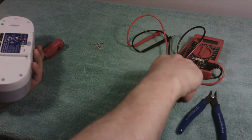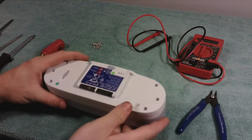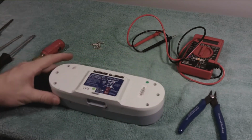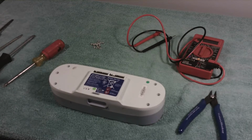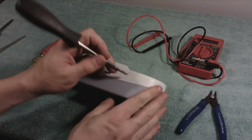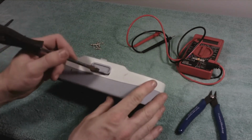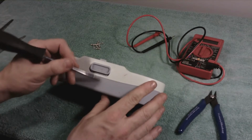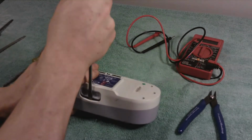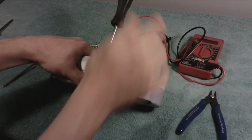I need to install not only enough solar to power the mining rig, but enough solar to power the mining rig for 24 hours. To make this really simple, let's say my mining rig pulls 250 watts, and I get sun for 6 hours a day, which is actually true. I would then need at least 1,000 watts of solar panels to run that 250 watt rig. The math there: there are 24 hours in a day and 6 hours of sunlight, so I need to multiply by 4. Whatever my rig pulls times 4 is what I'm going to need.